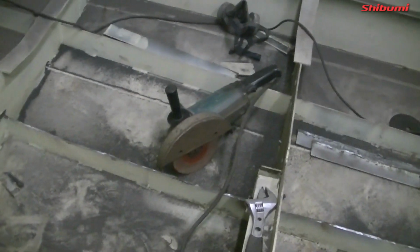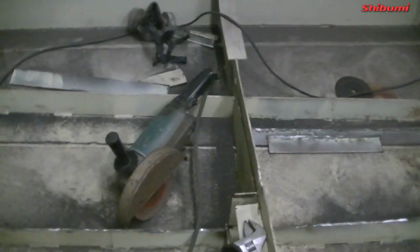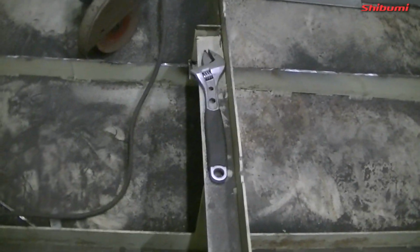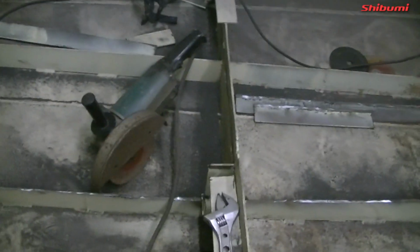So while the plasma did actually cut that bit out quite successfully, I actually ended up damaging the ceramic on it, which I've ordered new parts for, so I didn't have any. So in order to keep going, I went back to my trusty old 35-year-old angle grinder, and have successfully taken out that piece, and I've started chewing. Now I replaced the strap that goes along there, but I need to cut them in to start them onto the tanks and then work from the tanks backwards. So the same on this side, that one is out, and this one is out.